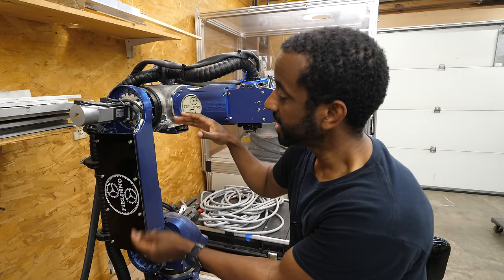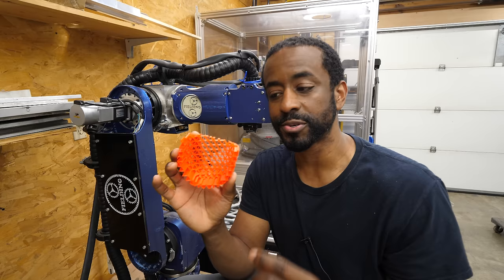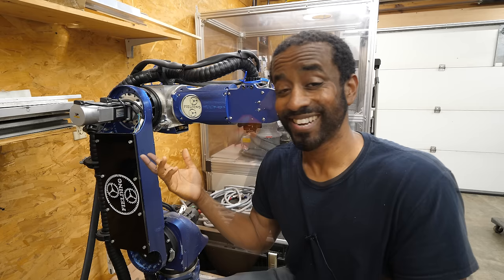One more challenge I need to resolve is how to maintain my tolerance between these holes — there are tolerance fits up here and down here, and I've never tried to machine carbon fiber before. I think the way I'm going to resolve that, since this is an experimental part anyway, is to make some aluminum inserts. I'll use the plastic infill to position the two aluminum inserts, machined out of plate, that fit here and down here. I honestly don't know — I am literally doing this for the first time.